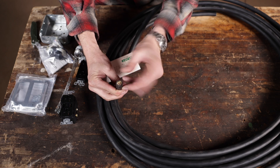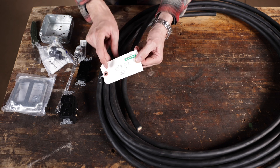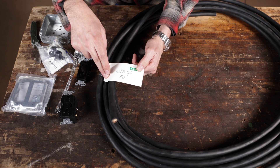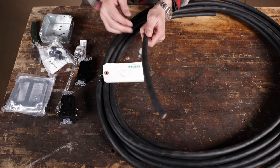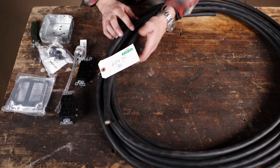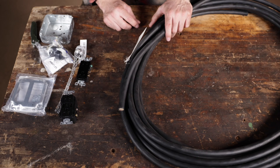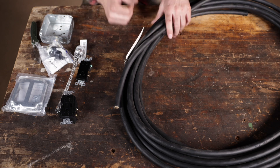When building your extension cord, what size do you want? You can save money going with a 12, but if you go with a 10 like this — which is really heavy — it gives you more versatility. You could use it as a welding lead or a 240 lead. It's worth the extra few bucks to go with the bigger wire for a shop cord. You'll forget the 30 bucks you saved with the smaller wire when you have that versatility. Also, 50-foot cords are the way to go — 100-foot cords are too long, unhandy, and miserable to wrap.